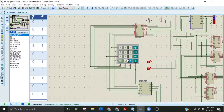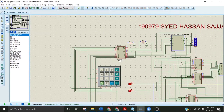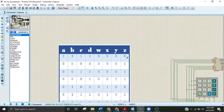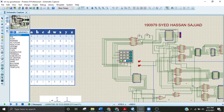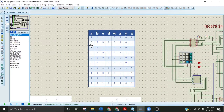I made this table because when I apply 0000, this IC outputs 1111. So comparing all the inputs and outputs: for example, pressing 2 — the output that should be 0010 — you will see 0010 is appearing here. So I compare all the inputs and outputs through this table.